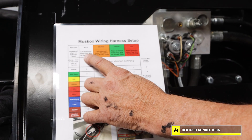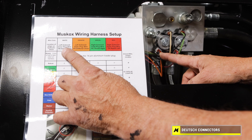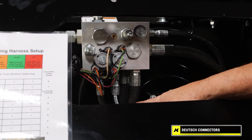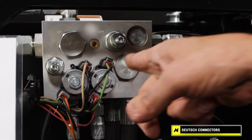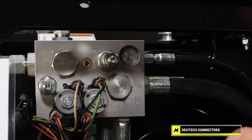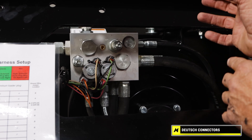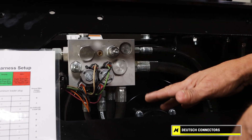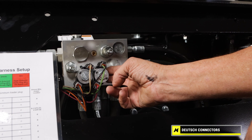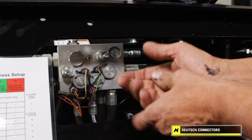The white wire is called left solenoid inner plug, and the orange wire is left solenoid outer plug. If you follow this setup you can see there are two solenoids — all they do is pull a needle in and out to feed hydraulic fluid through the lines to perform your different functions. You need to have the blower running to be able to function the chute flipper or rotate. It runs hydraulic fluid through this block, and you're really just stealing a little hydraulic flow through the solenoids to run those two functions.